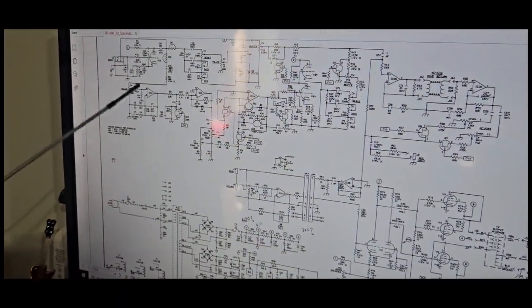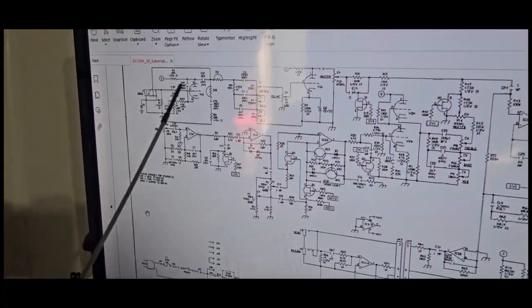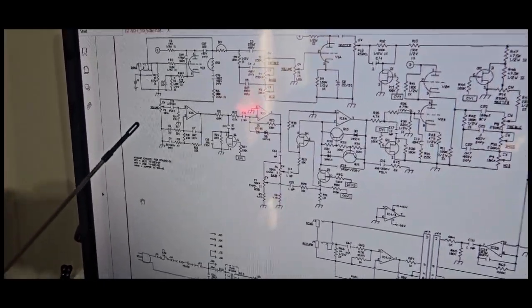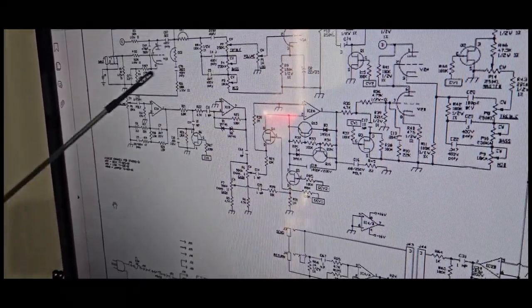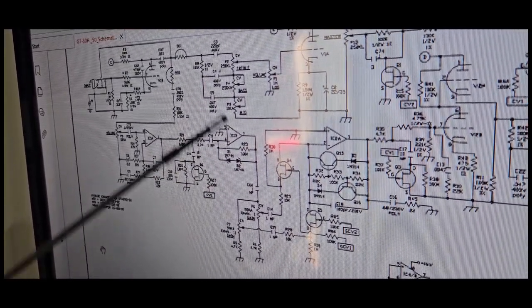So the real trick to these things, JCM 800 here, if you're in the clean channel, just smack the front end with a tube screamer if you're wanting that JCM 800 80s metal sound. If you want to do it with the amp itself, you can just bring in the gain 1 and play with your gains on that, because that is a tube screamer basically. If you look at the tube screamer schematic and the tube screamer on this, it's a little different because of the voltages. But if you look at the main components that make up a tube screamer, this is a tube screamer basically.